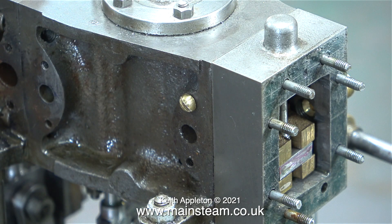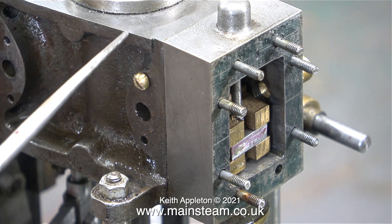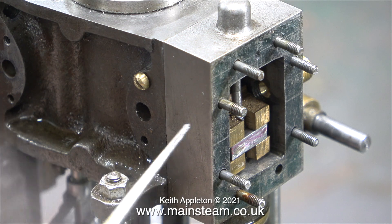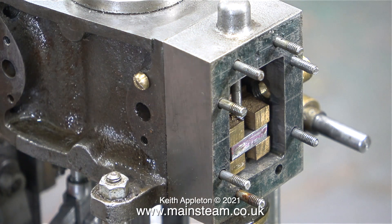The question is, where is the air leak coming from? I'm pretty sure that it's coming from the steamway that goes from the steam chest port face to the cylinder edge. It's important when building steam engines to make sure that you have the depth stop on your drilling machine set so you don't drill the holes too deeply.